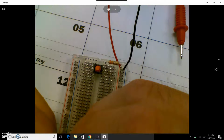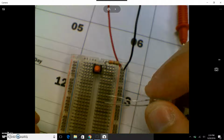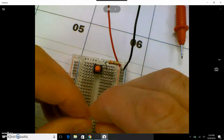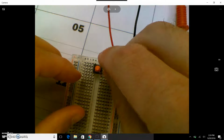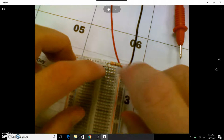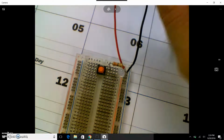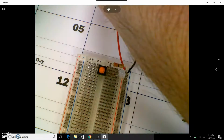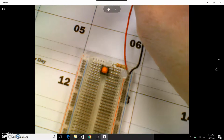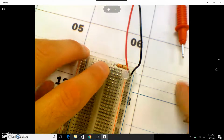As you look at your LEDs, the positive terminal on the bulb is the side that's the longest. Okay, that may not be clear sometimes, like this one's bent up enough it's hard to tell. A great way to tell is when you plug it in and push the button. If it doesn't light up, then it might be the wrong way or it might be a bad bulb. If it lights up red, that could mean that you have the polarity switched. For example, I push the button. It's hard for you to tell.